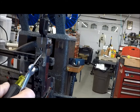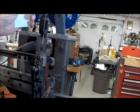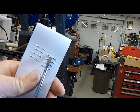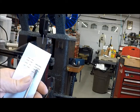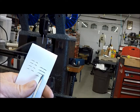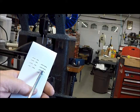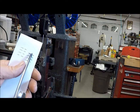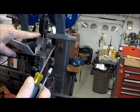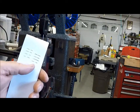This faceplate adjustment synchronizes those two. You're just using this to make a balance if you run different wire, or go from one extreme to another — like real thin material to real thick. If your legs aren't even, just make this adjustment until you get them like you want them. I personally leave about a sixteenth of an inch gap — I don't want the legs crashing into each other, but I also don't want them too short, because to me it just looks ugly. To make a nice staple, use this adjustment up here to make the legs the same so they match. You don't have to worry about counterclockwise or clockwise — just remember which way you went. Did it get worse? Did it get better? Make small adjustments until you get a nice, clean, symmetrical staple.